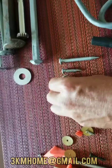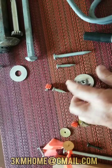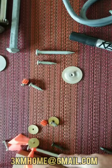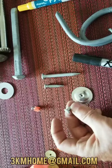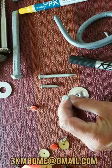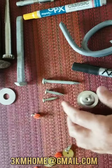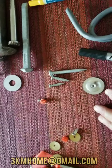Before mag nails, there were nails called PK nails. The difference is that PK nails are not magnetic, so if you wanted to find one again, you'd punch it through a tin and then find it with a metal detector. The mag nails they make now are magnetized, so they make really good control points. They've got a little punch on top so the rod sits in there very well, and they come in different lengths.